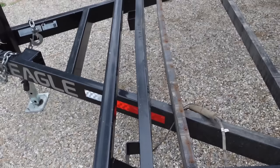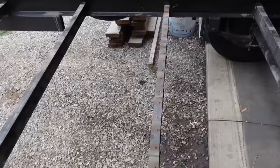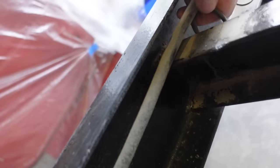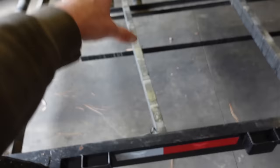I think what I'm gonna start with, honestly, while the rear end of the trailer is still sturdy enough to chain to, I'm gonna grab a come along and some chain, and try to straighten all these cross members out that are bent. All these welds that I welded to the frame are fine. It's just slightly bent. I saw one torn weld back here on that one. Yeah, that one right there has got a torn weld. So once we straighten that out, like I said, that's the worst one, and we got a ripped out weld. So we're gonna completely grind all that paint off and weld both sides back in.